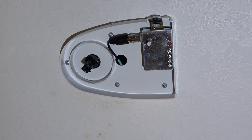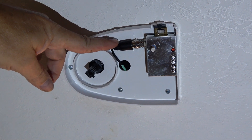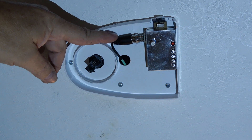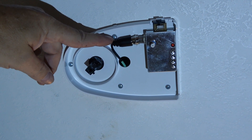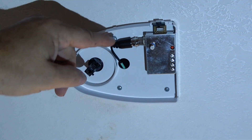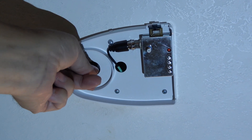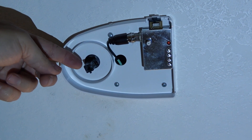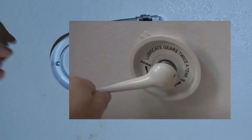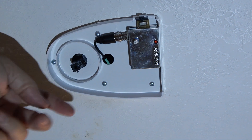I made a bit of a faux pas up on the roof and used the wrong input for my cable. I actually attached it to the cable that comes down behind the TV to where the power switch is for the power antenna, and that's wrong. I had to swap that - I put that cable on an open connection in the King Jack antenna and then had to run this cable down here because it connects to this level meter box. As far as the antenna rotation goes, I had to use the longer rod - the one on it was too short - so I used the optional one for a longer roof cavity.